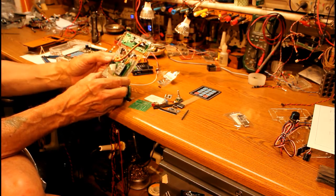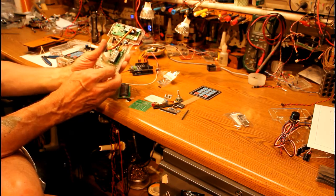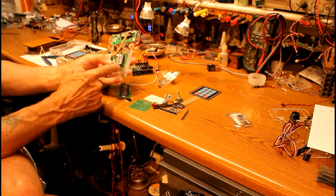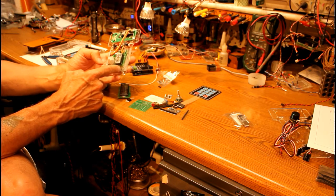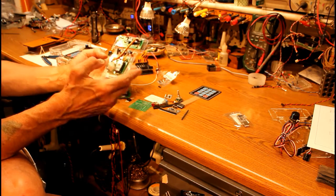Now, this case was not designed for a battery. This was designed for wired connection to the DCC++ controller. All you had to do for that was to connect 3 wires plus 5 volts, ground, and the transmit from the serial port directly to the DCC++ controller, and it works beautifully as a tethered non-wireless unit without a battery.